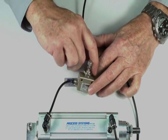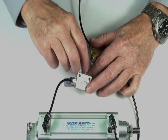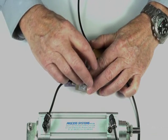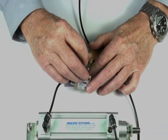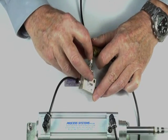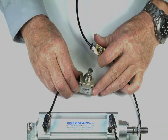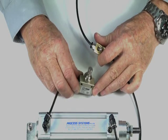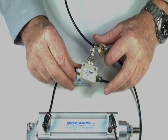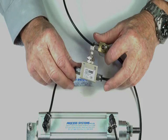So we wind it out to go faster, and winding it back in we'll get regulated speed. This precision needle flow control will give you the best of all the types of flow controls available, because it does have a very precise graduation.